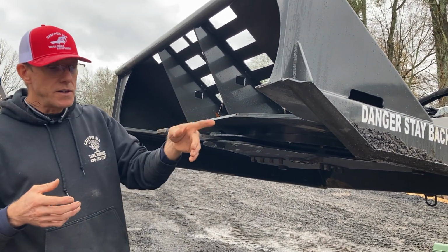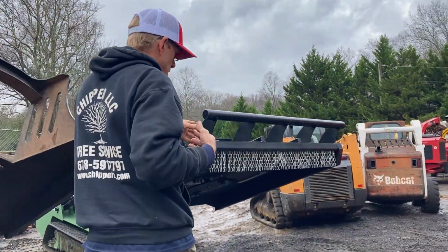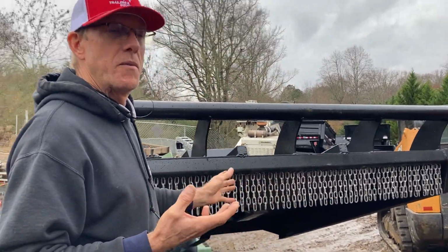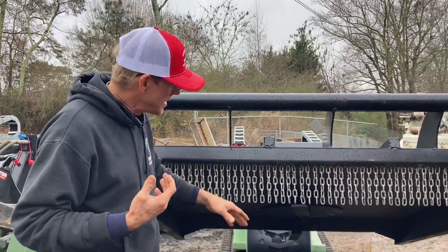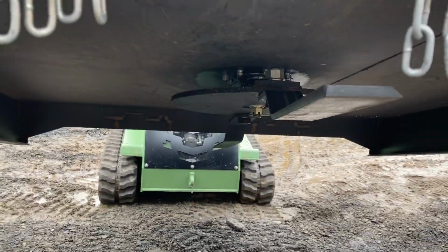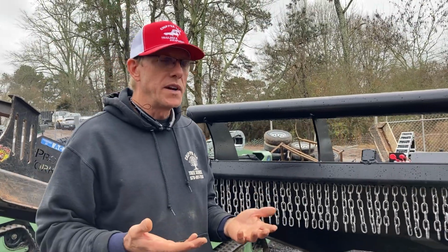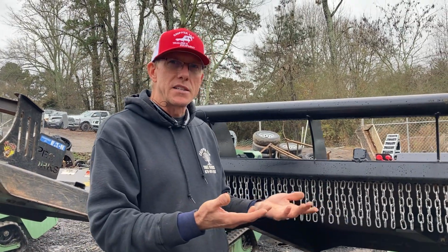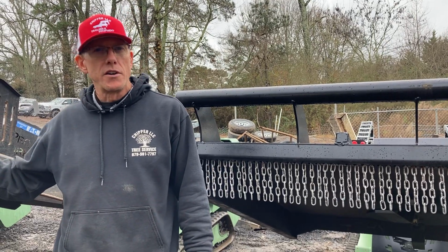Now, if you have it out in the field, in the grass, the actual grass mower will cut grass better than the brush mower, from my experience. And the reason is all this under here is not as heavy. It doesn't take as much to get up to speed, so its recovery is higher. So when you go through a thick patch and it gets under load, it'll recover and come back up to speed faster than all that inertia over there.